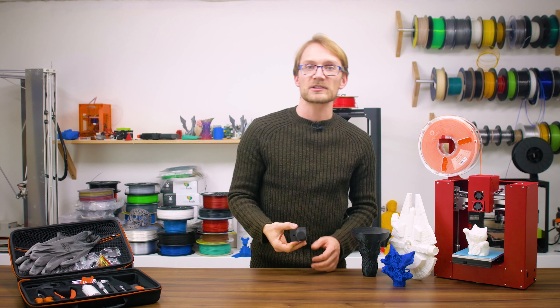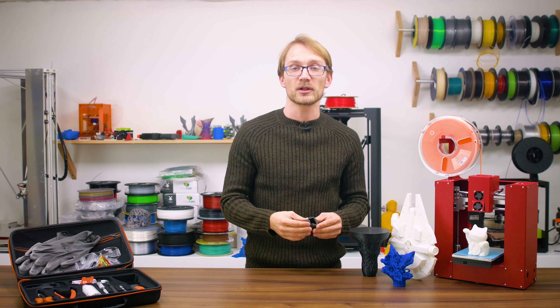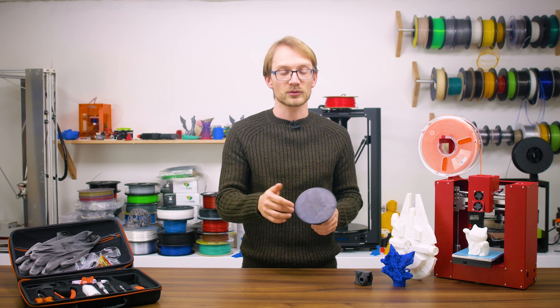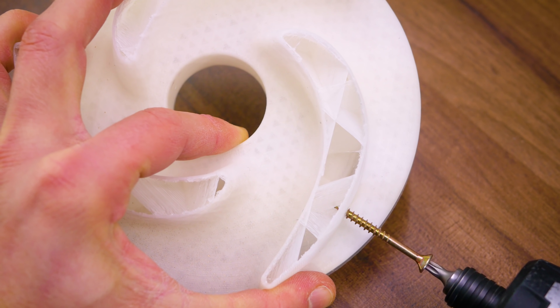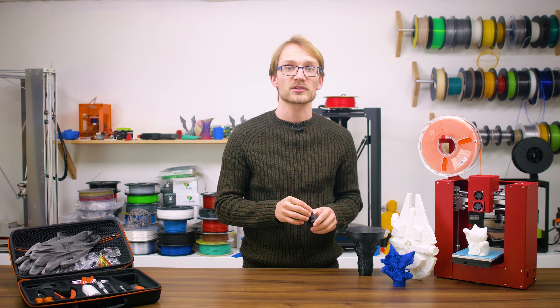Next up, functional geometry. Obviously, if a part doesn't fit, you can always file it to size, and most 3D printed plastics can also be milled and sawed if you really have to. Drilling and reaming also works, but you shouldn't just take a plain surface and make a through hole or screw a wood screw into it when you don't have the proper geometry already in place. Not having the extra material from the extra walls will really limit how strong those connections are going to end up.